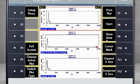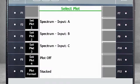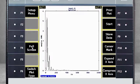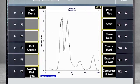Now you can store the data in job mode using the F9 key or review immediately by selecting F6 Switch Plot Type. You can select what you want to see. Here you have three directions active, but you could easily disable channels B and C to focus on channel A. Next use F11 Expand, and now you are able to clearly see the two natural frequencies.